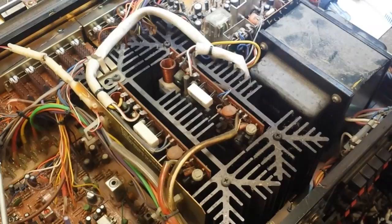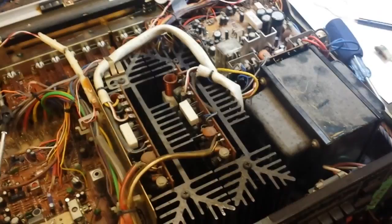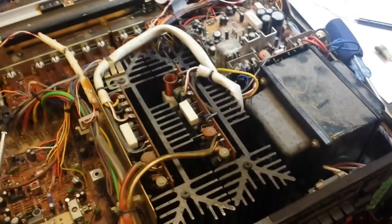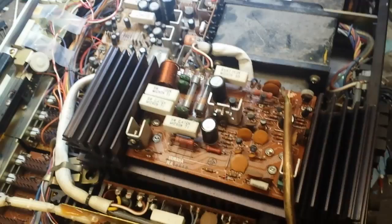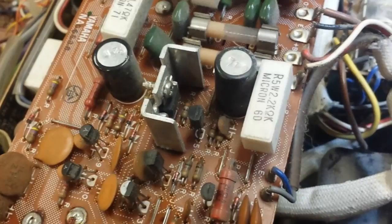The next thing we'll focus on is the amplifier boards, because it's very common for the screws that hold the driver transistors to the circuit board to break loose. Those screws also carry collector current, and when they break loose they create loud popping and cracking and throw the machine into protect. With the board up, the class A driver here needs to be tightened down. Then flip the machine over and make sure the output transistors are secured.